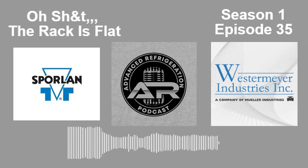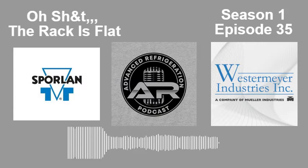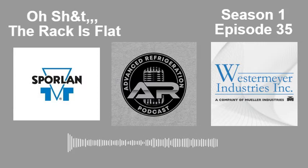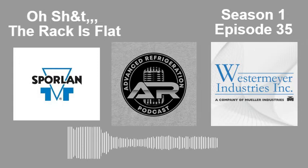Once you get the vacuum going, don't purge it — just take the extra half hour, let it pull in vacuum, and get everything out of there. When the refrigerant gets here, you hope you got it in bottles and not small tanks. But let's be honest — with how cheap 90% of companies are, you're getting small tanks.